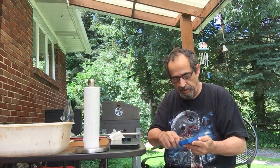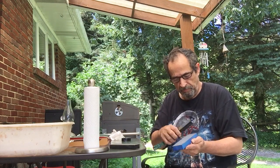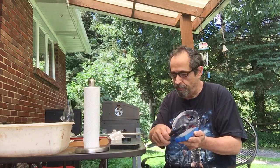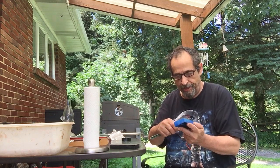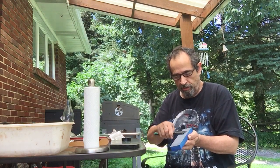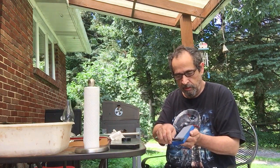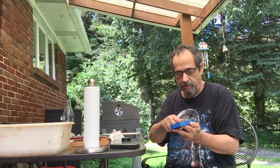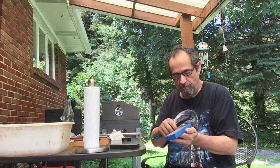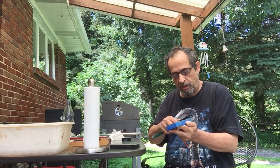We go to the blue DMT. It's very important to make sure you do have a clean bevel. If you're setting a bevel, you have to set the whole bevel — you have to make sure the entire blade edge has been set, or you end up polishing an edge that's not ready and it won't shave. You can't just polish an edge that's not sharp and expect it to shave. You have to have the bevel set correctly first.